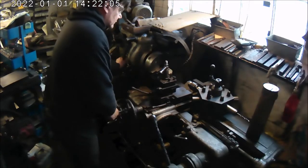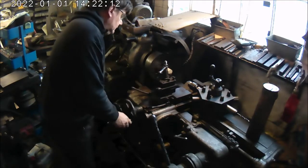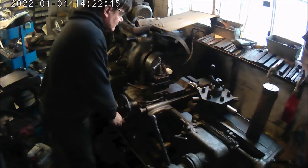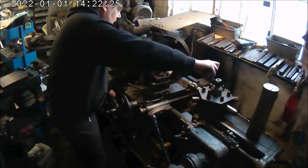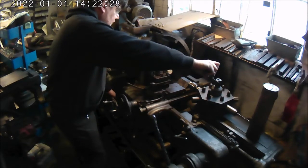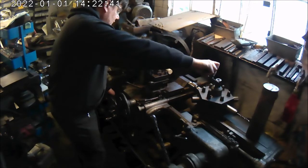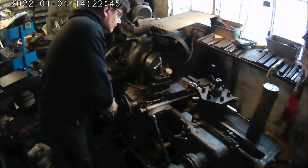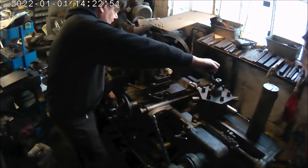These kits were originally fitted with quite an elaborate sort of mudguard spoiler type of thing, just like you would get on an aeroplane's wheels. But that's not the plan for us. Like I said, we want to keep it very functional. And the space that was taken up on the axles to house all this fairing and mudguard type assembly, what I'm doing now is basically cutting the axle back, trimming it right the way back, turning it all the way down so that the wheel will fit a lot closer to the axle, and then tapping a new 18mm thread on the end of it to hold the wheel on.